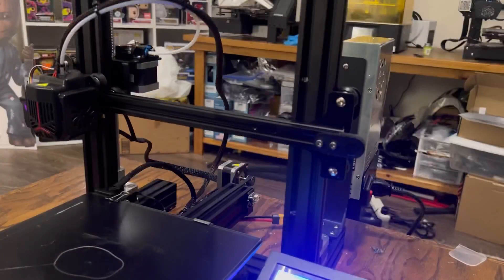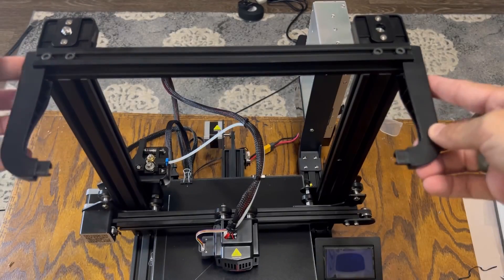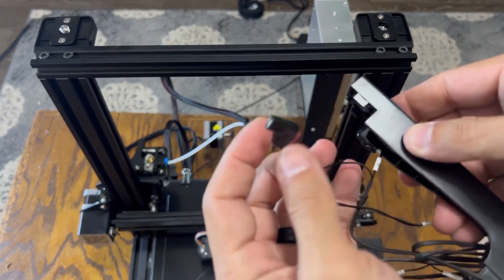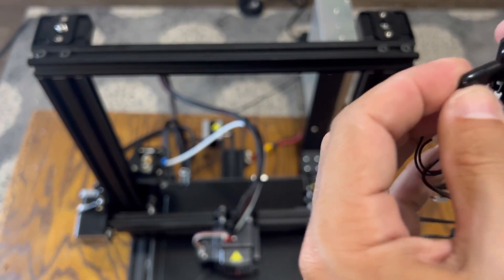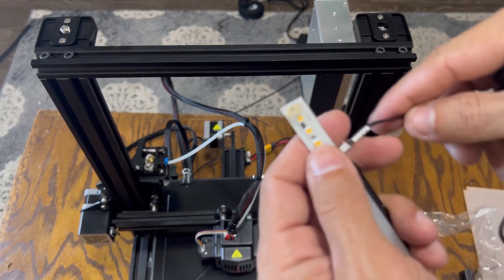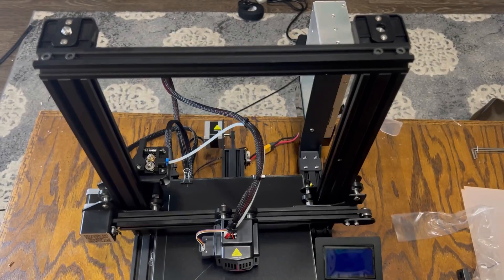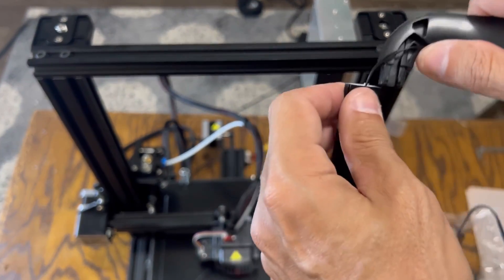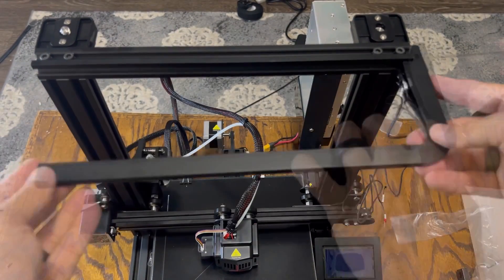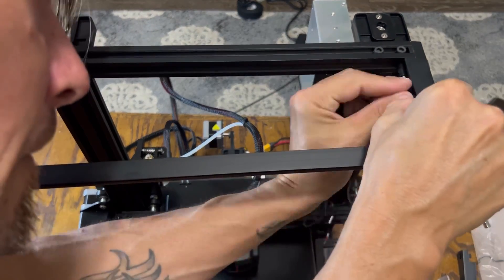After a quick test to make sure the Z moves up and down freely with no bindings, we can start working on the LED light bar. This is pretty straightforward with a little bit of wiring. We're going to mount the left and right brackets onto the printer, and it provides a pre-wired harness that plugs into the on/off switch and the LED light bar. Get everything plugged in, mount everything first, then get the wires concealed in the channels within the mounts and run them down to the motherboard.